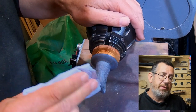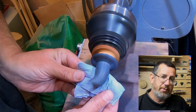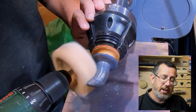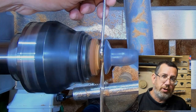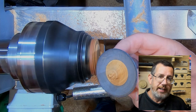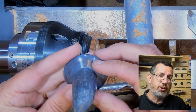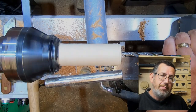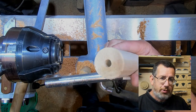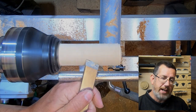Because of the odd shape of the hat I've had to use my buffing mop on the drill just to fully buff up the wax, and it doesn't knock out a lot of hairs — I had to pick those all out afterwards. For parting off, the best way is to take it down near the side since it hasn't got sharp edges so it shouldn't catch — probably safer than using calipers. As I've got the 10mm spigot in the hat, I then just drill a 10mm hole in the top of the body, about 20–30mm deep, so that when I part it off I've still got a full-length hole for the hat to locate in.